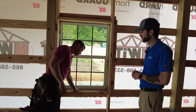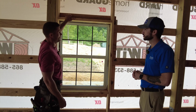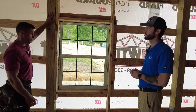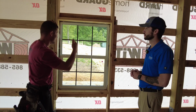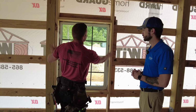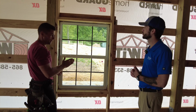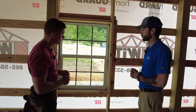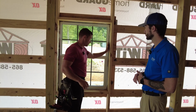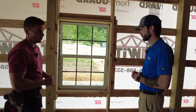I've got your window sill here, along with a header, which is not really holding anything. That's the reason why it's just a single 2x6 right here, because all the weight, as you can tell, is sitting on these steel trusses, which are on the 6x6. So there's no overhead load. And then of course we put some to finish out the frame of the box. I like to attach it between 4 or 5 of the purlins all the way up, so it's nice and tight to keep away from the sway, because it is on an 8-foot span. Everything's framed in with 2x6, and of course we take our building wrap and wrap it on the inside of the window, and that helps if any water gets back there, to keep it from rotting.